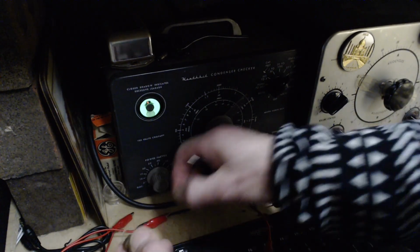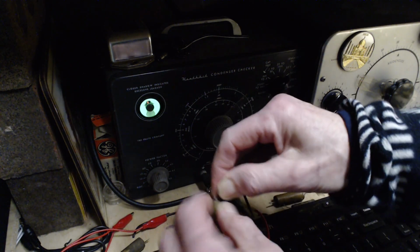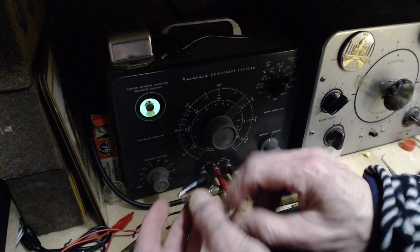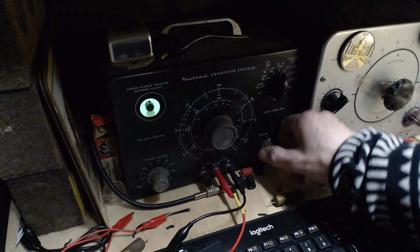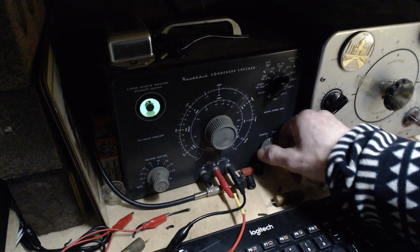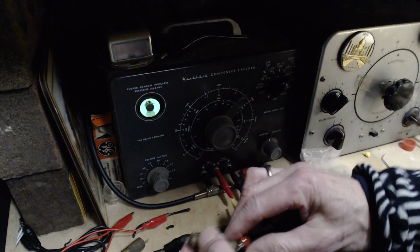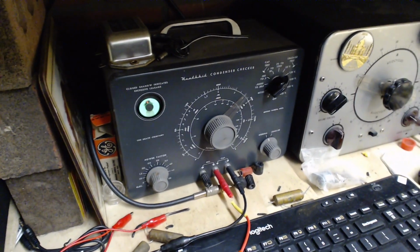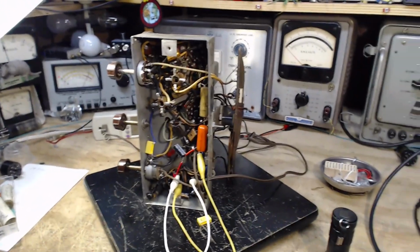So all in all these capacitors I'm testing from this radio are proving to be a little better than average in an old radio like this. And it's probably reflective of the life journey that radio's been on, how much time it's spent in somebody's garage and stuff like that. Here we go. That one opened up pretty good. How about 150? No. Not happening. Okay. These two, their positions, not critical if they're leaking a little bit. It wouldn't really matter, I don't think.